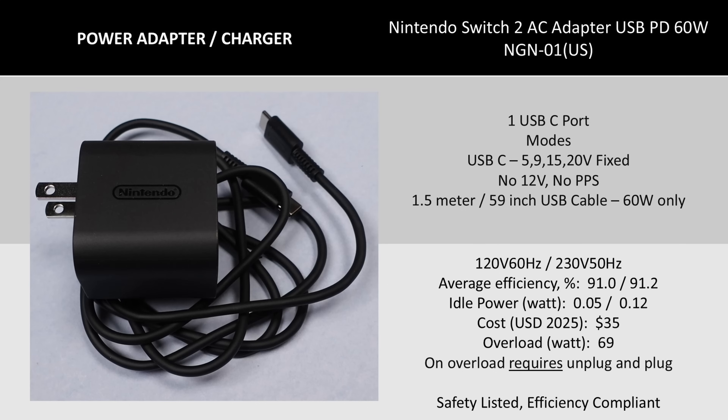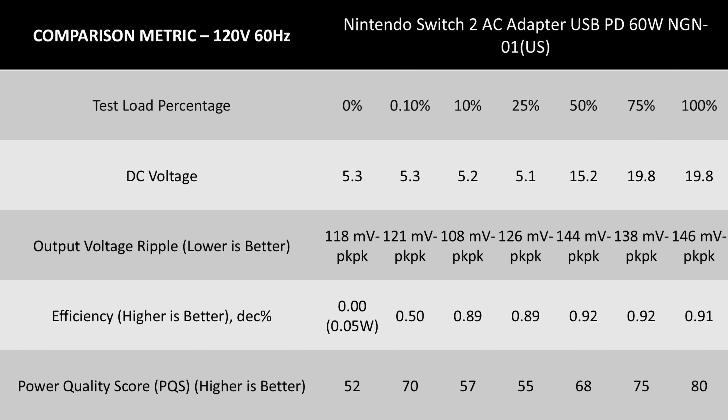The adapter's basic performance is pretty decent. The voltage is stable in every mode offered, and although the ripple looks a little high, it didn't really change much for each mode, so it's just the way this one operates. It's going to be fine for the needs it's designed for — charging batteries and powering some digital circuits. The idle power usage is very low, and the low level efficiency is also high. Not much to say beyond: it's a pretty good charger. If it's good thermally and isolation-wise it's looking good, then it's probably a decent choice for the power level. As expected, low power quality on the AC side.